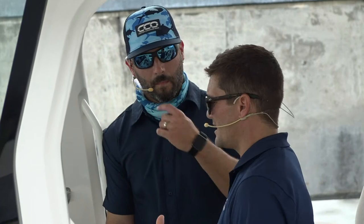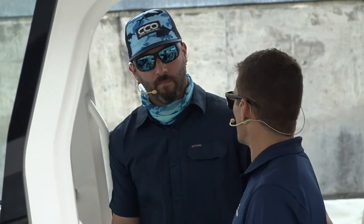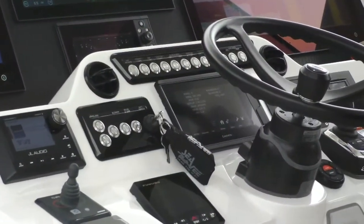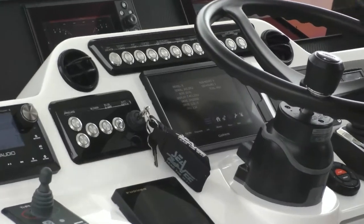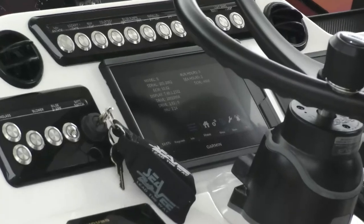Then in the larger AC units, so the Seakeeper 5, 6, and above, you have zincs, small zincs. That's routine, minor things. Every 150 hours or 3 months, you're changing zincs out depending on where you keep the boat. Okay, gotcha.